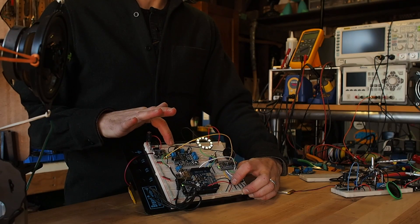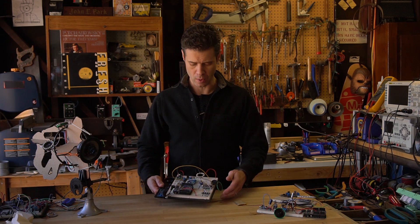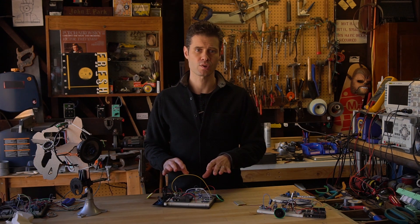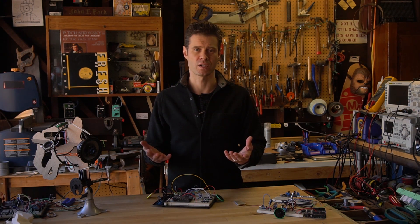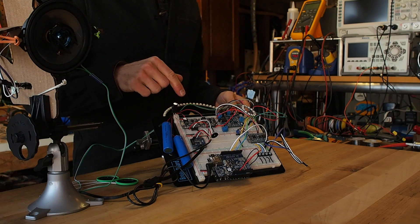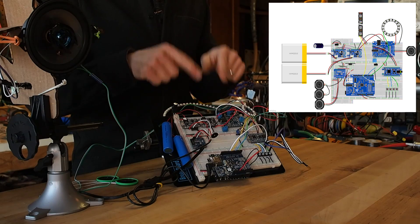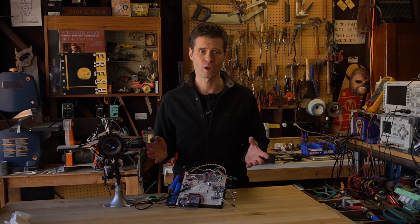This is something that happens to this board when it is starved of power. I realized that running all of this through the same power supply was going to cause some problems, and we're also going to lose that stereo separation. My solution to the power consumption problem was pretty simple. I took a second battery and power boost converter, added it to the circuit tying in ground, and now I'm running the 20 watt amplifier off of that second power supply. Everything else is running off of the first one.